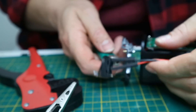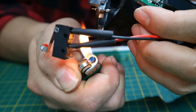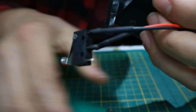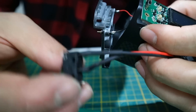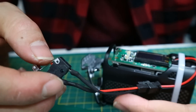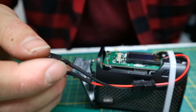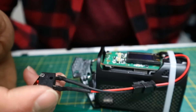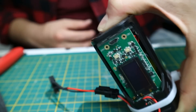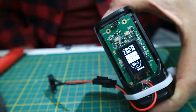Release the clamps and grab a lighter. If you don't want to use a lighter you can use a heat gun, but a lighter is faster. Watch that tube shrink. There we go! We have now simulated this button over here and guided it through to a new button — you can make this cable as long as you want. If the engine is in your backpack and you want the switch in the palm of your hand or in your shoe, just make the wire as long as you need. I've put it halfway back together — let's press the button. Beep beep! Hey, what do you know — it works!